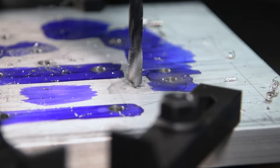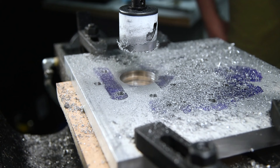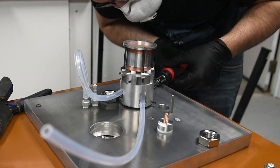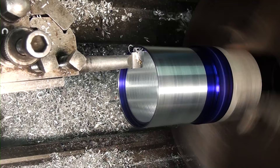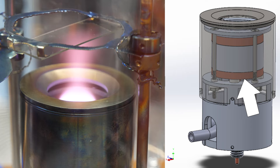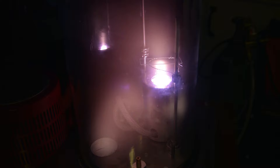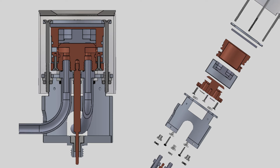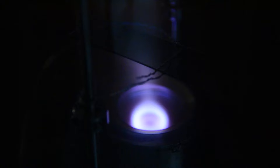The base plate was made in basically the same way — each hole carefully marked out, then drilled, and some needed to be tapped. The main hole for the diffusion pump was cut using a hole saw since it was oversized, and like the baffle, it had to be thoroughly polished so that everything will seal to it. Now let's move on to the magnetron sputtering head. This assembly has the most pieces by far of anything in the system, and it alone took more than a week of machining. Something that makes this assembly super weird is that the outer shell has to be grounded while the core has to be floating at usually 600 to 800 volts DC, and the whole thing is going to fill up with plasma.